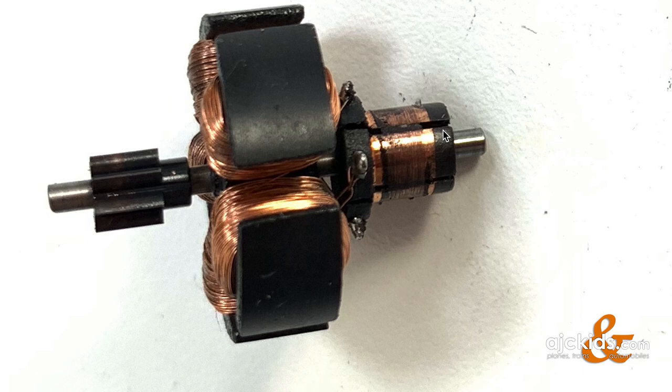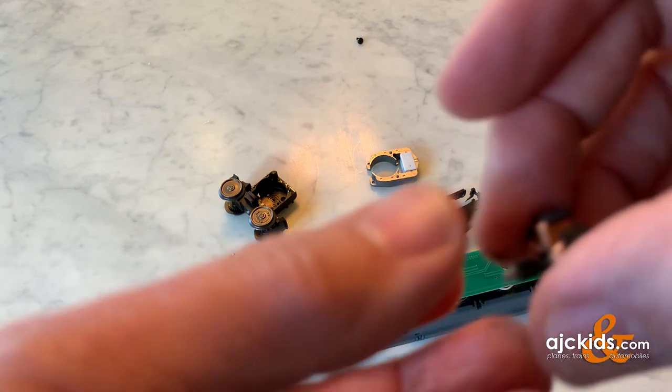While we're looking at this armature, as you can see, there are one, two, three, four, five spools — and that's why this is called a five-pole motor. Every spool is wired to its own little plate, and this is called a collector plate. This collector is in the style of a drum, and that's why they also call this a drum collector motor — a DCM motor.